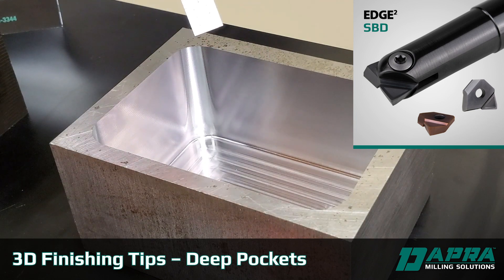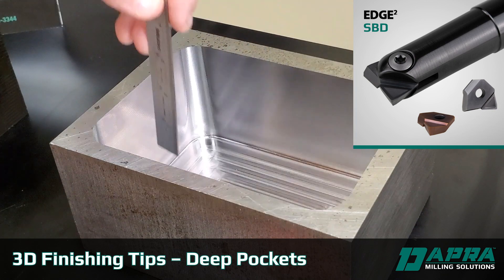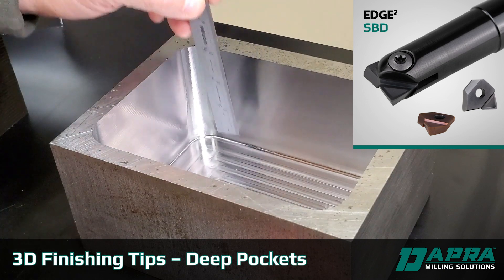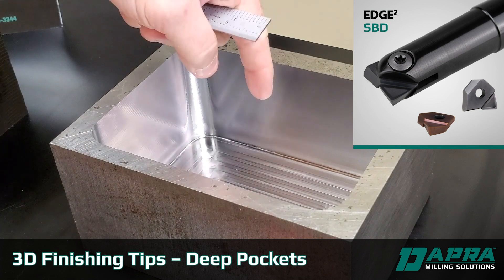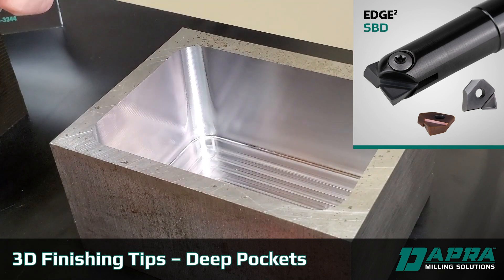The use of a backdraft tool engages a very small amount of the insert so that tool pressure is held to a minimum. By using either a racetrack profiling routine or a plunge finishing routine that creeps around the pocket, your backdraft cutter will give you a straight wall every time and a very, very nice surface finish, as you can see in this part.